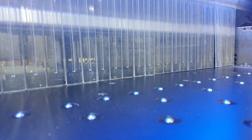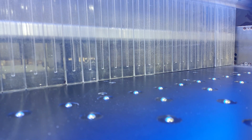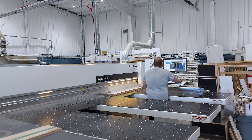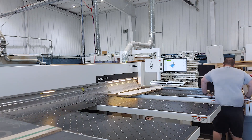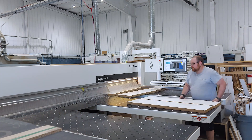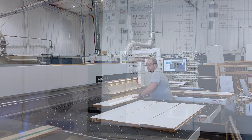One of the biggest productions for me was eight sheets of three-eighths plywood for dovetail material. That was a total of nine jobs all mixed together, and I cut 45 drawer bottoms in 15 minutes — all of them labeled and sorted out, none of them mixed together, all through the saw software. Made it very easy.